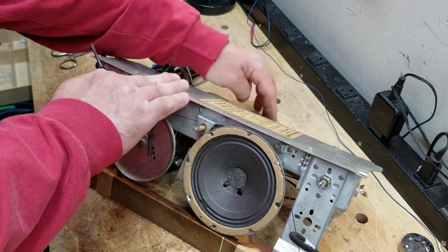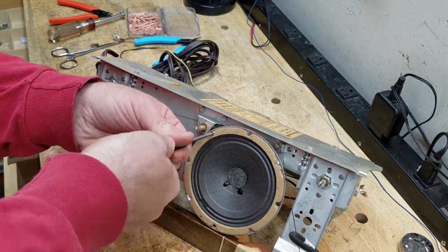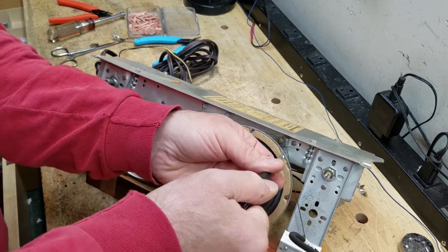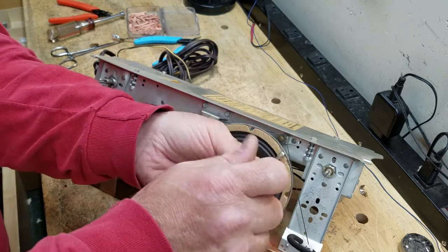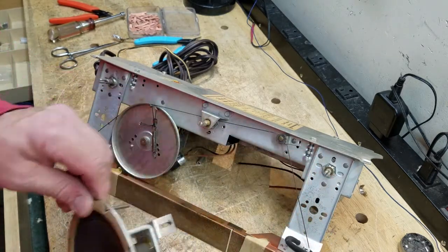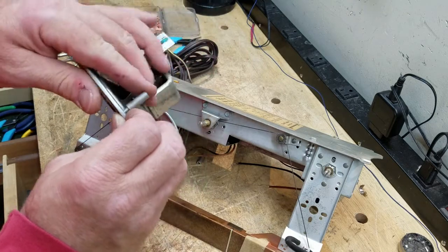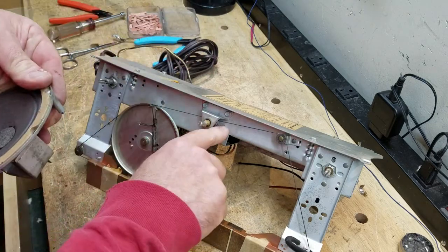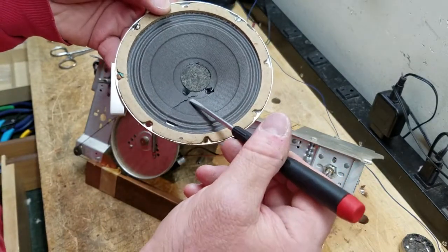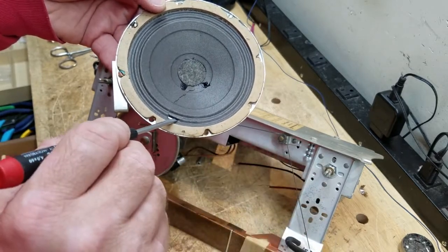This is a nice solid frame, so it's okay to set this down. I already checked these IF transformer cans — they're on there nice and firm. There are a couple of standoffs behind these screws for the speaker so that it can sit off the chassis a certain distance. The screws go through the speaker and there's a standoff there. There's a small tear right here, barely visible, and then a bigger tear right here. Both of these can be repaired quite easily, so I'll go ahead and fix those, and I'll fix this little hole here too.